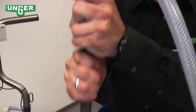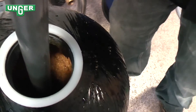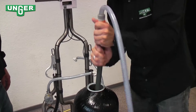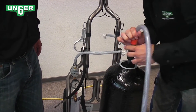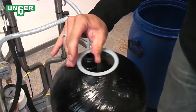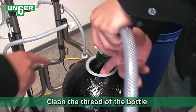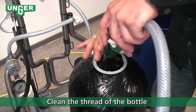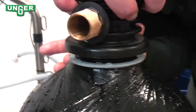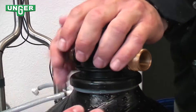After you've changed out the 25 liters of resin, you're going to stick your pole back in the middle and attach a water hose to the top. As the water goes through, slowly push down so that it goes to the bottom. Turn the water off. Make sure that the thread on the inside of the tank is completely clean.